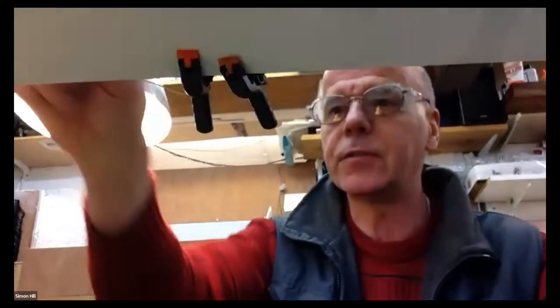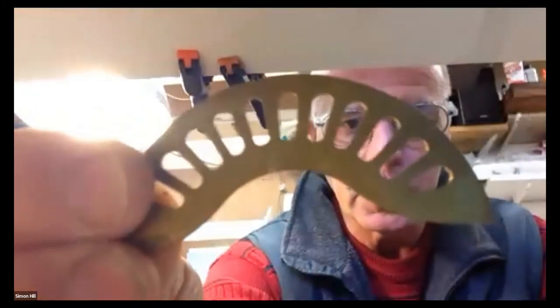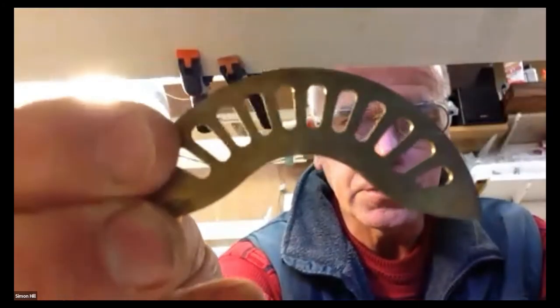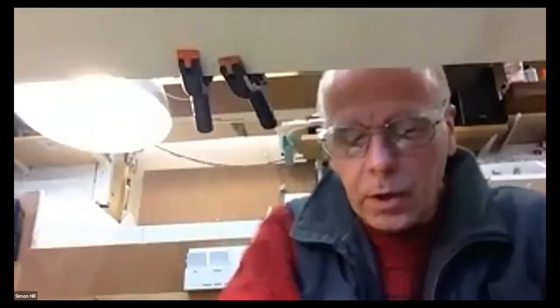Yeah, I did a Stirling single probably about 20 years ago. Well, I actually did three of them, one for a customer, one for me, and a spare set. And just thinking about what you showed earlier with a set of splashers, that was the original splasher I cut just to test out the theory. Did you do that by drilling a series of holes and then slotting them all together? No, that's done by filing. And I tend to use machinery to do a lot of the cutting, so that was done on a pantograph engraver.